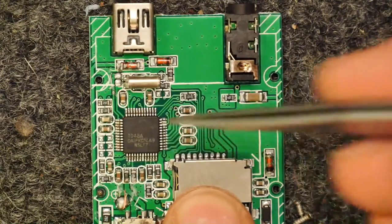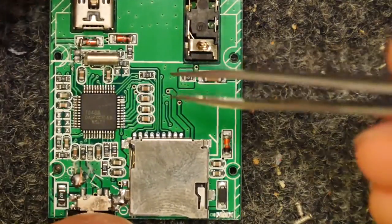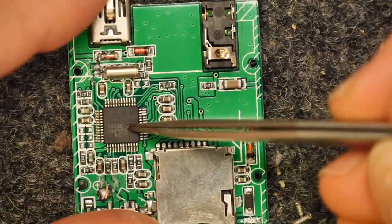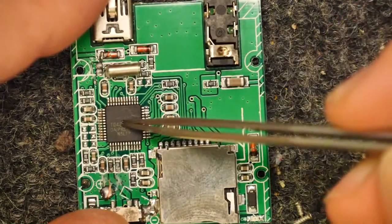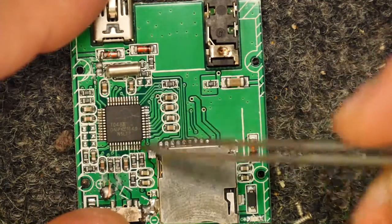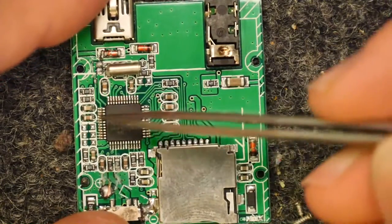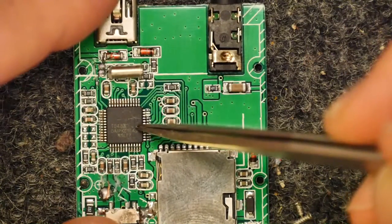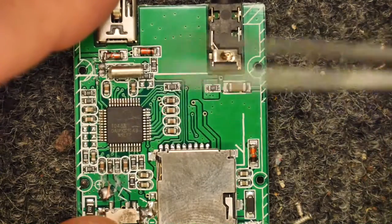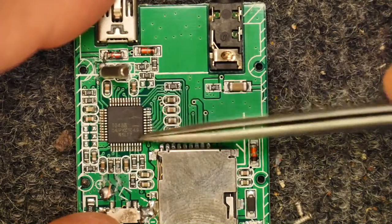So this is a single chip that seems to be doing everything. You've got a single chip here that seems to be doing everything — it's clearly acting as the USB controller for this card, because once you plug this into a PC, you can access the memory card as a pen drive. And also it must contain all of the amplification circuitry for the headphone amp, because there's absolutely nothing else there. So it's the flash, USB controller, probably a bit of a microcontroller on there — everything needed in one. That's quite a nice chip. There's your crystal, the timing circuit for this chip.